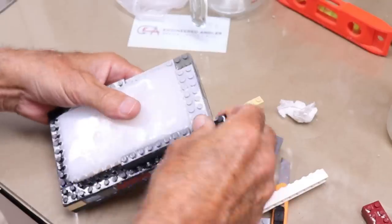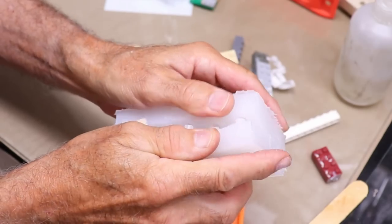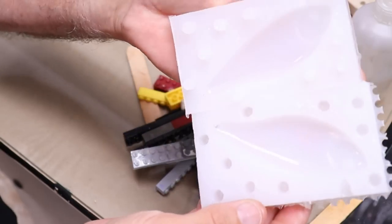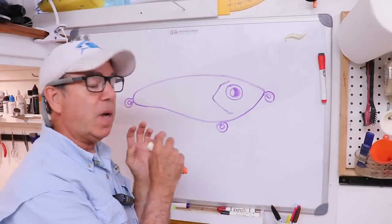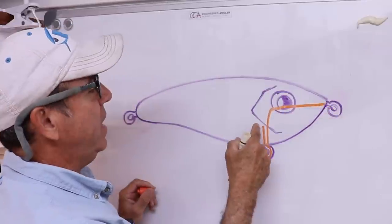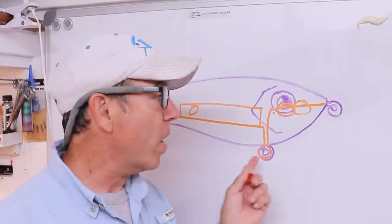Now we pull this thing apart. There you can see the sprue at the top and the very tips of our vents — and it's opening, which is a good sign. Nice — a smooth and shiny surface. Now I form a wire harness. Think about what you're going to put inside the lure — weights, a rattle — and make sure the harness supports all that. I like to run back almost horizontal to the first bend, down to the belly eye with an offset, then back to the tail hook eye. This gives room for weights up near the head and the offset allows for a rattle chamber.